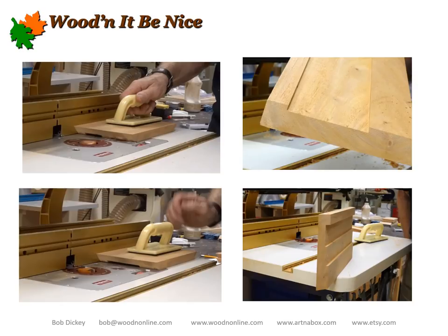The profile cut is done in multiple steps. First I do that one-eighth-inch depth across the full area that's going to be relieved for the glides for this profile. Then, raising the bit another eighth of an inch, I come back and deepen the cut for the top tray and the top rail.